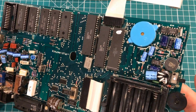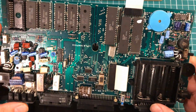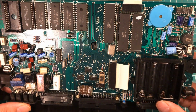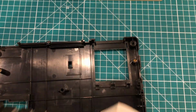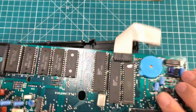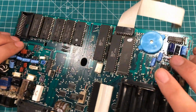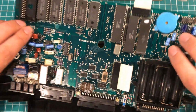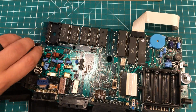Oh, there is a NiCad battery in there. It doesn't appear to have leaked yet, but that thing is going away fast, quick, and in a hurry. As far as the battery goes, I don't really see any leakage from the battery itself. But let's go ahead and get this NiCad out of there. You can see it's starting to leak. It hasn't fully leaked yet, but it is starting to leak. So that number 1 is gonna go.